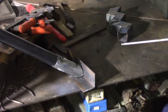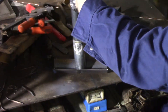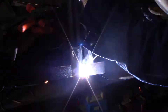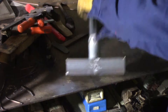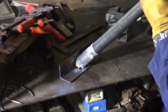Now I'm just going to use a stick welder to get this angle onto the top of the plate. Just want to make sure it's pretty much in the center — tack on each side and then I'll weld around. Too much amperage for that, so I'll need to knock the amperage back. See if I can go down around 75. If I can't, I might have to see if I can get a smaller rod and go a little bit lower.